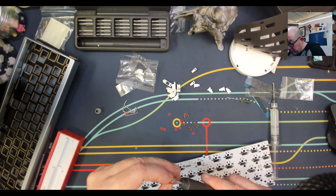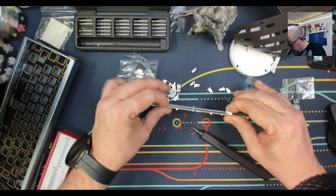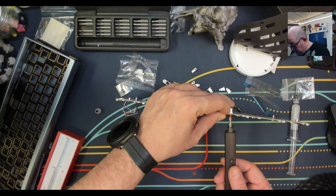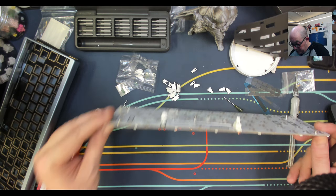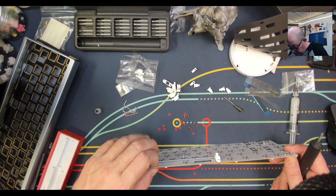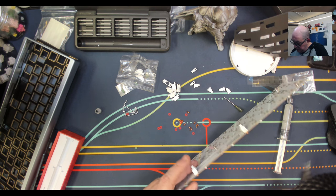All right, so we've got the washer on there. And normally these, when you press it in, they snap into place. Why it's not happening here, I don't know, but I'm going to go ahead and do it this way. Please don't over-tighten. You are dealing with a PCB, and though they're not as sensitive as they were in the 90s, you can still damage it. It's just easier to do it this way, so the washer won't come off the screw because of gravity. And we just do it until it's tight.